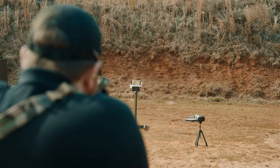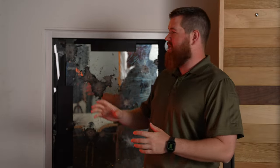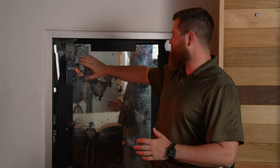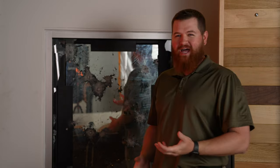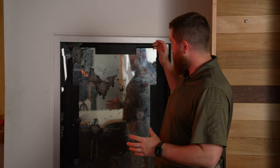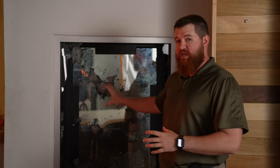This is actually one of our demo kits we've shot for ballistic testing. What you can see here is our normal extruded aluminum framing that you would see on the outside of the building. You can see some remnants of the commercial glass, which of course disappeared as soon as it was shot. But then in behind it, we have the heavy-duty ballistic steel framing that's holding the top-of-the-line rifle-rated ballistic glass in place.